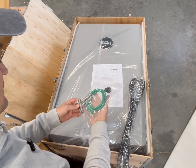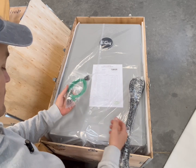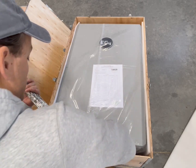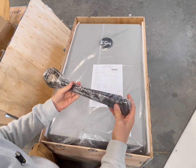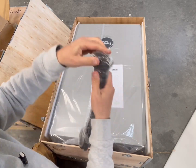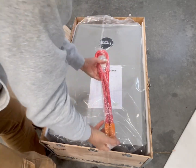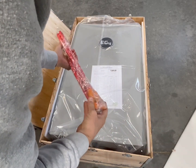So this looks like the communication cable, and then we've got some wedge anchors to hold the mounting plate onto masonry, negative cables, and the positives are probably on the other side. These have Amphenol connectors - the quick disconnect types. These snap onto the terminals. The positives were on that side. I believe these are 2/0 gauge cables.